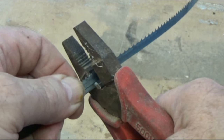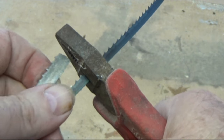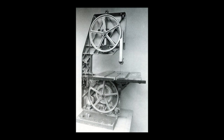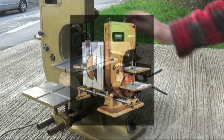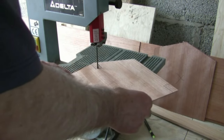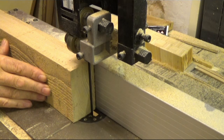I've been using these hard tip blades for decades and the bulk of the metal is soft enough to cut and even break by fatiguing. Importantly, the blade metal is soft enough to go around small diameter bandsaw wheels, though that in itself is fatiguing if you use too wide a blade, as I've done on this tiny Emco Star bandsaw. I just love tools and machines, and having small bandsaws set up with narrow blades complements my hefty bandsaw that I use for thicker work.